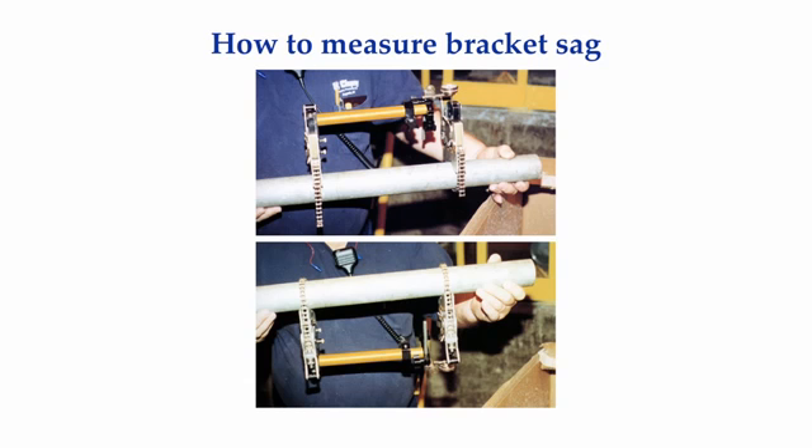There are four factors that affect bracket sag: the amount of overhung weight, the weight of the dial indicator, the weight of the clamp that holds the indicator on the span bar, and the incremental weight of the span bar itself. The next factor is the span of the bracket — are you reaching out 4 inches, 12 inches, or 20 inches? The next factor is the stiffness of the span bar and bracket, and the last factor is clamping force or clamping pressure.